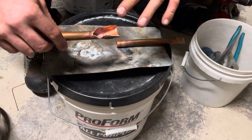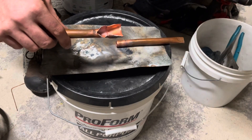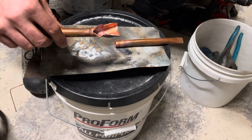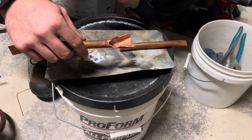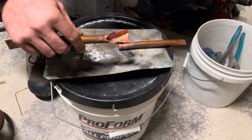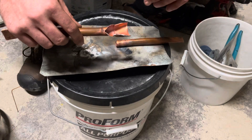I'm not saying that you should do this in place of flowing nitrogen. It's for a very specific situation where you've already got refrigerant in the system so there's no oxygen in there — you only need to flush out a little portion. Why would you use it? Maybe you're out of nitrogen. There are also cases where it can be very difficult to flow nitrogen for one reason or another. In the case I'm working on today, which got me thinking about this, I have hundreds and hundreds of feet of line set — just a big spider web on a pretty large system. I'm thinking this honestly might provide a cleaner braze than trying to flow through all of that and possibly end up with pinhole leaks if the pressure ends up too high in certain areas.